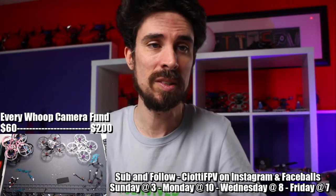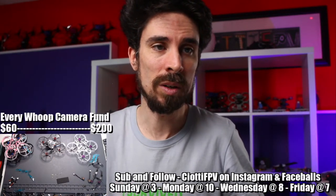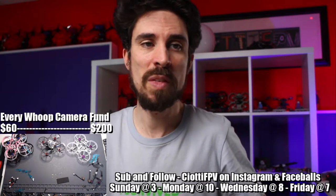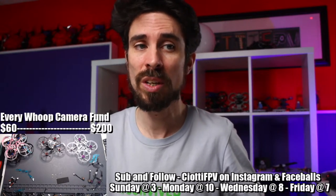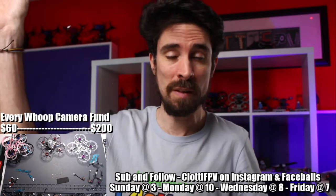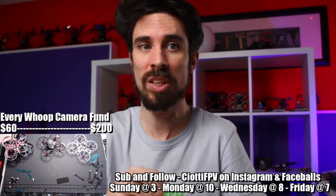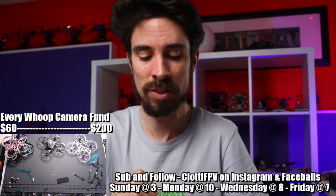Gray Hat says, Ali has a few Mobula 6 ELRSs, the old version. You can tell because it's ELRS SPI. The new one is UART, I think. Also, the weight is heavier, 1 gram on the old one. Interesting. If you're basing that off of pictures, don't. They put a picture up and they'll leave it there forever, and then they ship you whatever is on the shelf. So if that's based on the images they have uploaded, don't trust that. They're probably going to send you the new one.